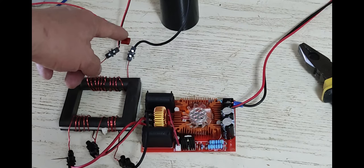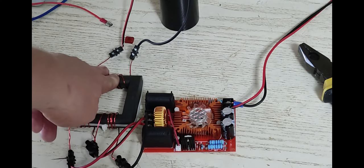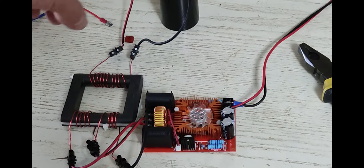I have a tiny 100 nanofarad, 250 volt, actually it's a 400 volt, metalized film capacitor over there. I was trying to match the resonance frequency of the primary of my ignition coil with the secondary. That is roughly the right capacitance to do that if you don't take into account that you've got this coil connected in parallel with the primary of your ignition coil. That drastically lowers the inductance. As those of you that know, when you connect two inductors in parallel, the new inductance becomes the reciprocal of the sum of the reciprocals of the inductances, so it decreases. Same way that when you connect two resistors in parallel, it reduces the resistance.